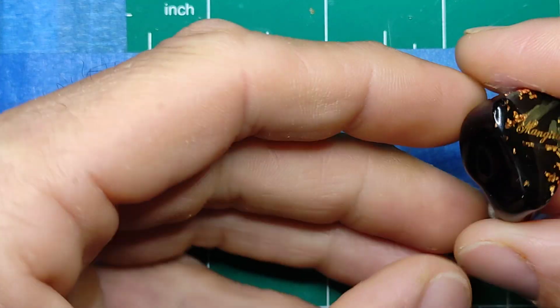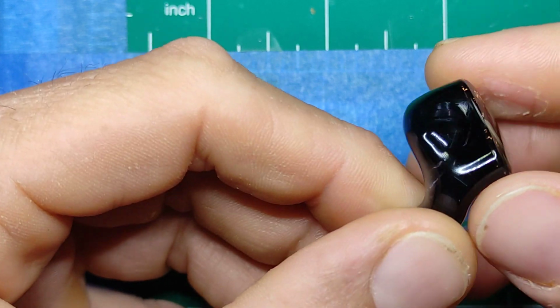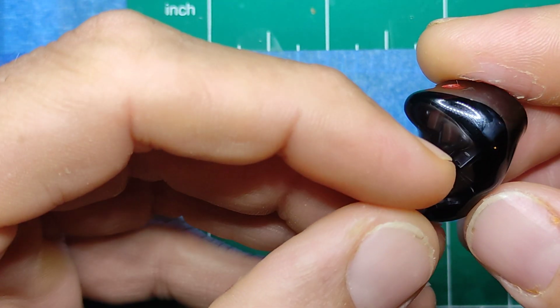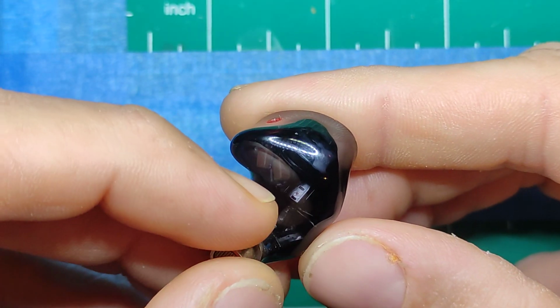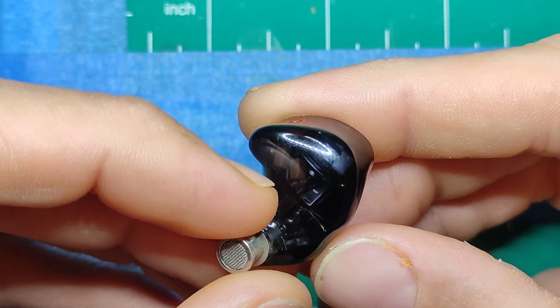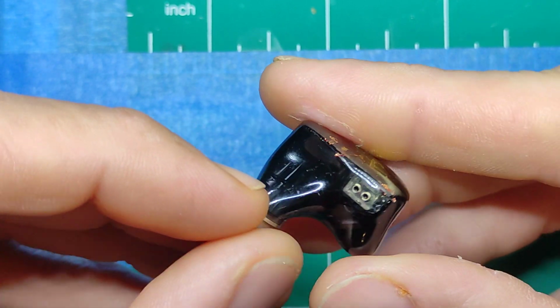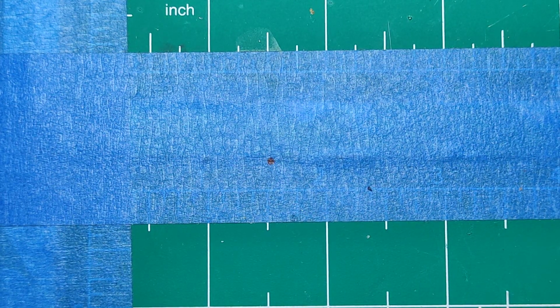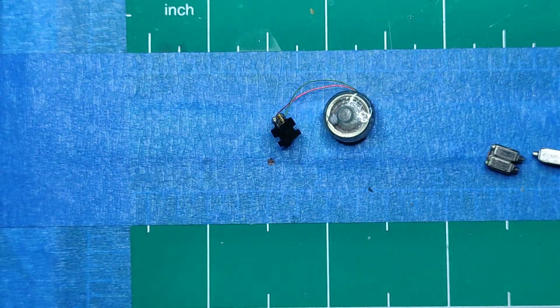So anyway, long story short, they use two of the 33518 for the treble, and then for the mid BAs there are four Sonion. Let me move it over a little bit so you can see kind of the bottom of them. So there's 2 and 2. There are no dual BAs inside here. Every model is just a single BA that they glued together. And real quick, I will show you guys. Let me just pause for a second. I'll show you the mid BAs that are inside. Alright guys, I'm back.